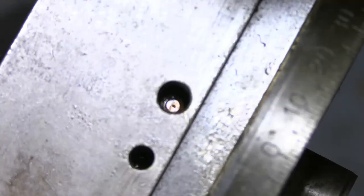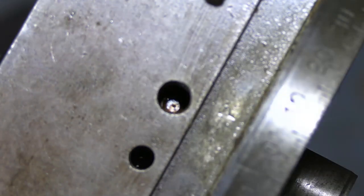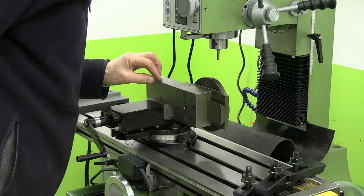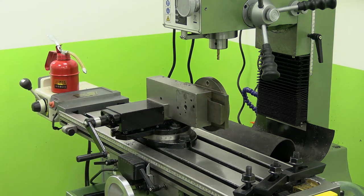What I could do is drill into this and tap it, but I can't tap it because I can't stop it rotating — and I don't know the shape of it. Well, I tried to drill it out by hand but that didn't work, so I'm going to try and gently mill it out. The trouble is I obviously can't see what I'm doing, so I have to keep winding it out, have a look and see whether I'm getting the gib or not, then winding it back again. And repeat.